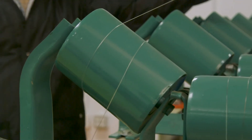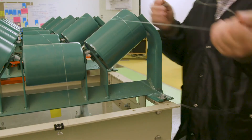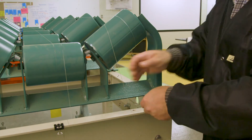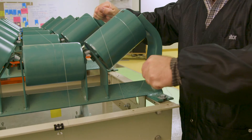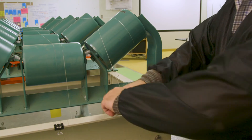The string is then stretched out over all the idlers until the last idler. On the last idler, wrap the string around as you did on the first one and down to the frame of the conveyor. Wrap the string around the frame one time to make it easy to cinch the string to a very tight state. Once the string is tight enough that there is no sag in the line, tie it off to the frame. Repeat this process for the other strings.